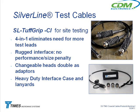So we came out with one with changeable interfaces — this comes as a kit with all of the other interfaces included. This one is the N. But if they're out there and it's not an N female or N male they need to connect to, they can connect an adapter. So if it's a female coming down, all they have to do is slap on the adapter and they're all set. Basically it's like four test cables in one.